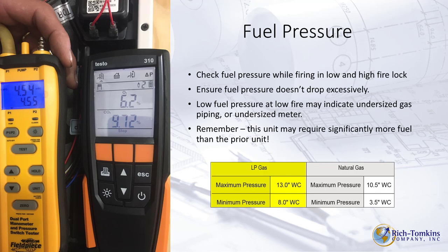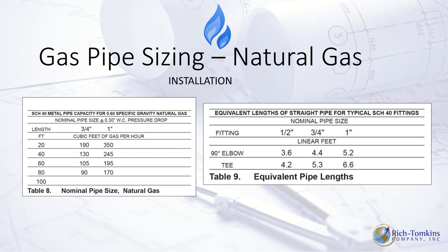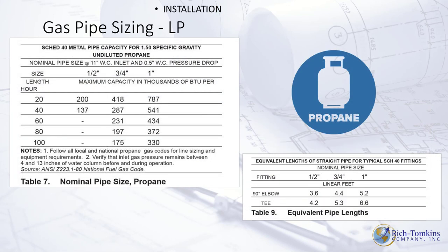For gas pipe sizing at 199,000 BTU: on natural gas, a 3/4-inch pipe at 20 feet can only handle up to 190,000 BTU, so you'd need to bump up to 1 inch — not including fitting equivalent lengths, which must also be accounted for. For propane, a 1/2-inch pipe at 20 feet can handle 200,000 BTU, so you can handle the 199K on half-inch, provided total equivalent length is within 20 feet. Otherwise, move up to 3/4 inch, which can handle 418,000 BTU — zero problem for these units.